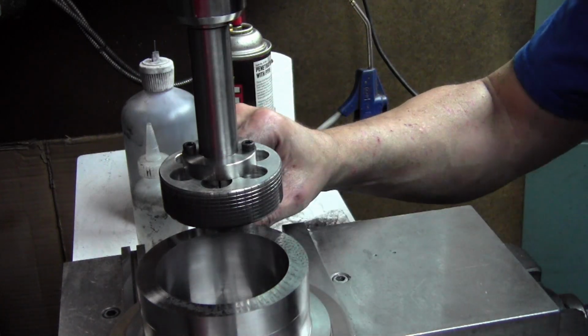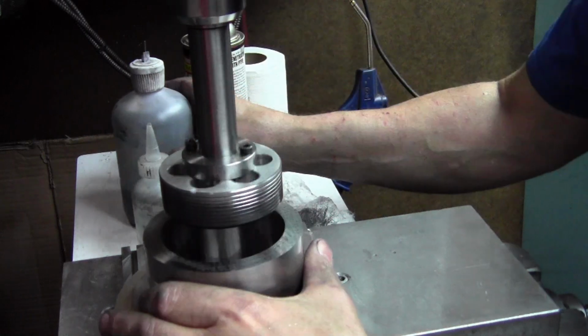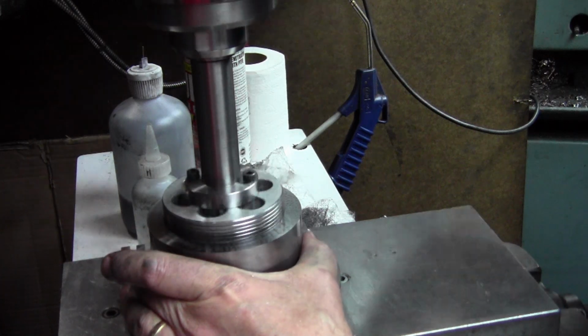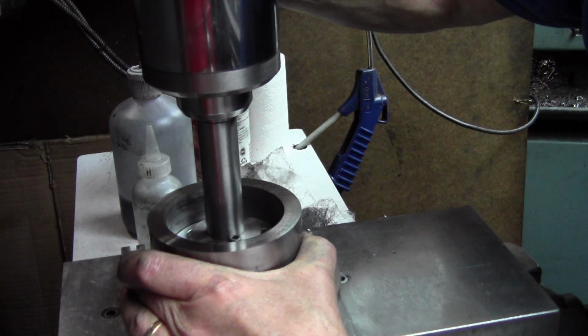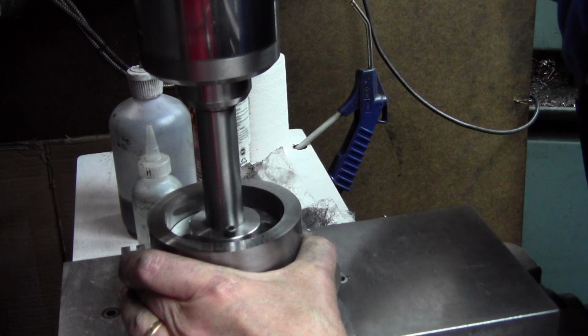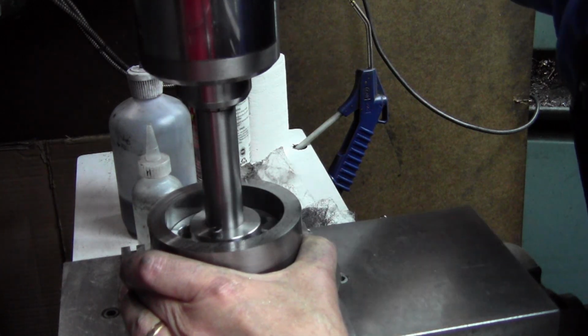Take my Allen wrench, tweak a little more feed on or a little more expansion on there, and you want just enough that you're cutting. If you push too hard, you'll rip the particles out of the aluminum. They'll just tumble around and not cut. There's a happy medium there where you've got enough drag to cut well, plus being able to hold on to it.